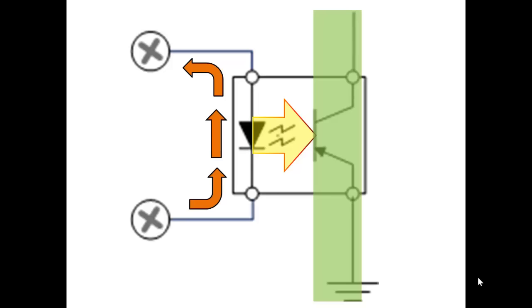Okay, a little more detail. This is a diagram that portrays the connection between an actual input device and the PLC's memory. Always remember that there is no connection between the input device and the ladder logic instructions that use their state. The actual input devices turn bits in memory on and off, and the instructions read the states of those bits, just like a contact on a relay basically reads the state of the coil. You could say that the bit in memory controlled by the input device represents the state of the input device.